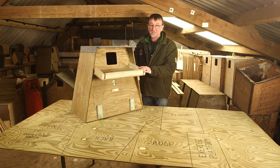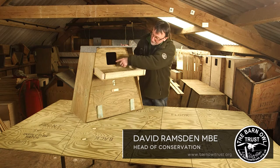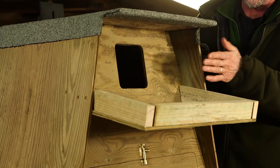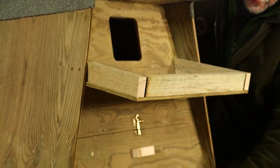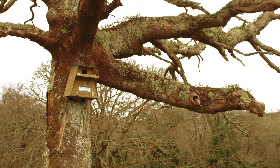These boxes are pretty easy to make. The angles might look a bit complicated but they're all there for a reason. The entrance hole is set back between the sides, the roof overhangs a little bit further, the tray is angled downwards, there's drainage gaps, the vertical joints are all sealed with a weatherproof sealant, and the sides overhang the floor. This is all done to try and keep the contents dry — that's really important.